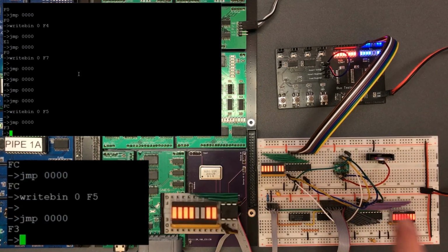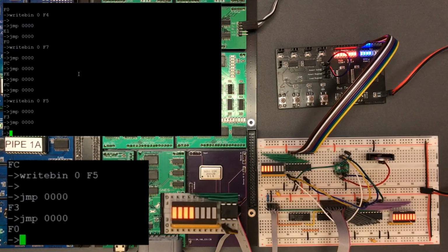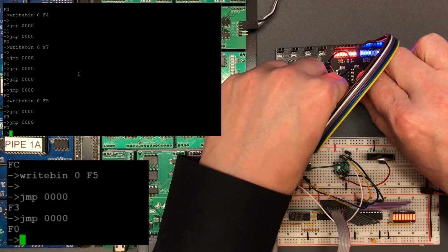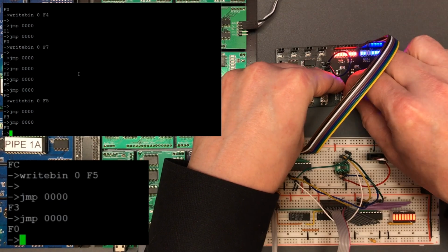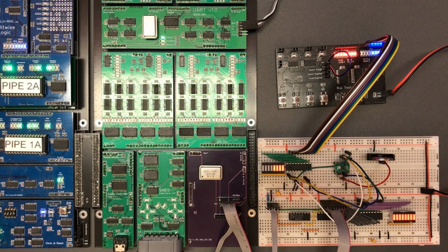Okay, that's correct for what we've got on the dip switches. As is that. Let's try swapping these all around. Awesome. Now I'm confident that that's working correctly. I was just slightly worried that first time we got it working because I could see I hadn't changed the phase I was reading the bit in. And what we were doing is we were reading the bit immediately before it changed. And whilst that would work most of the time, it's not something you want to rely on.